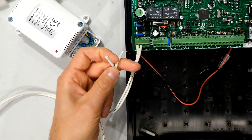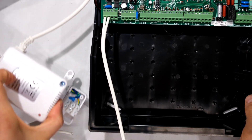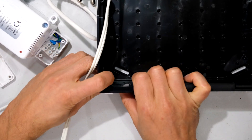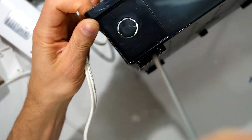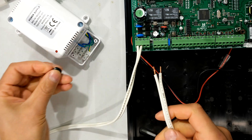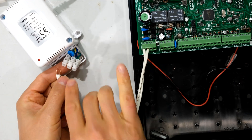On the other side I'll do the same — strip 8mm. You need to decide where this cable will run: is the power supply going to be on this side or on top? That determines which gland space you puncture. If the cable runs along the bottom, I'll knock out this gland space here. Then I thread the power cable through the gland. This contraption has a grommet the wire must pass through first, and then I grab the terminal block and insert the wires after opening the screws.